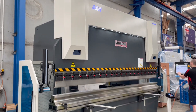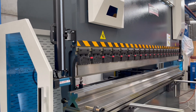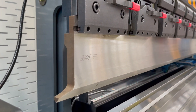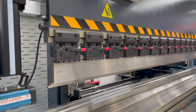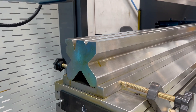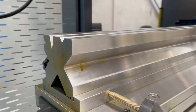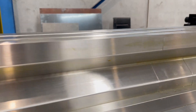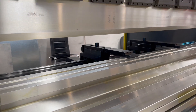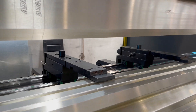This particular customer has ordered some custom tooling. Generally the 5-axis and 7-axis CNC press brakes will have standard top tooling — the same as this top gooseneck here, which is segmented — but also Euro bottom tooling. However, this customer has requested a heavy-duty 150-150 bottom multiple V die block sitting in a cradle, segmented up into smaller pieces so he can segment his bottom die block. Being a 7-axis machine, the back gauge fingers are motorised and fully programmable via the controller.